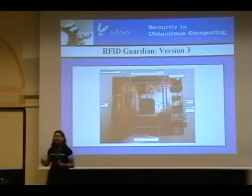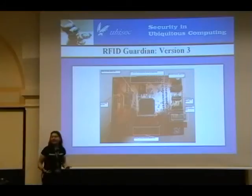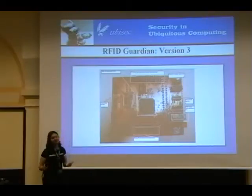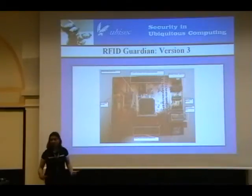Now you have a place where you can plug in the analog front ends. This is good not just because if you design an analog front end and completely screw up, you can just unplug it, redesign the piece that's broken, and plug it in again. But it's also handy because you can design an analog front end for high frequency RFID — like 13.56 megahertz — or you can do 125–135 kilohertz analog front ends like you'd have for the VeriChip that people inject into their arm, or the little chips that you put into your pets.